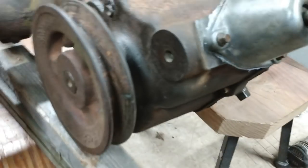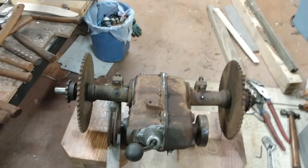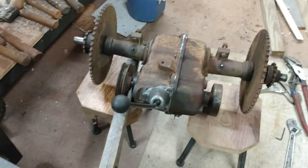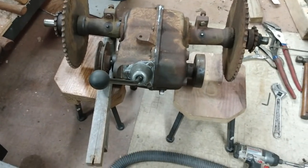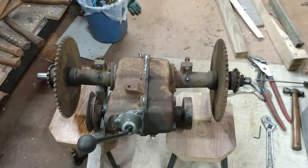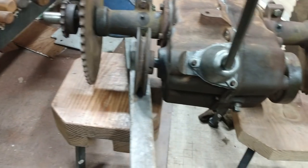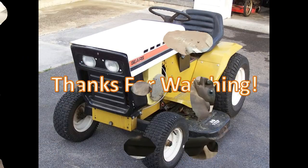Making progress — got the two halves back together, got the shifter cleaned up and back on there. I kind of wish I'd run a little more diesel fuel or brake cleaner through the bottom half since I didn't get it quite as clean as the top. I thought about running something through it one more time before putting the gear oil in. This video went longer than I intended and I probably repeated myself a lot like I usually do. This is the transaxle — no more wobbly input shaft, it's nice and snug and feels good. Hopefully ready to set this thing back in the tractor before too long.